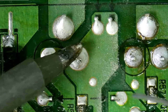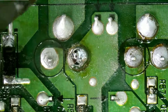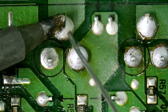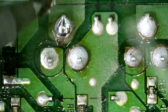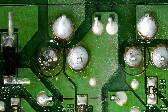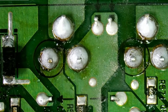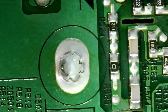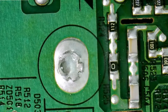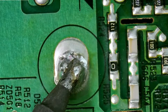Some of these joints I don't think actually need solder added — like this one over here doesn't have any cracks, it has a kind of crown inside the joint, which actually does help prevent cracking. I don't know why they don't do that for all the joints. Over here, our heatsinks are starting to have cracked joints so we'll go ahead and re-solder those as well.